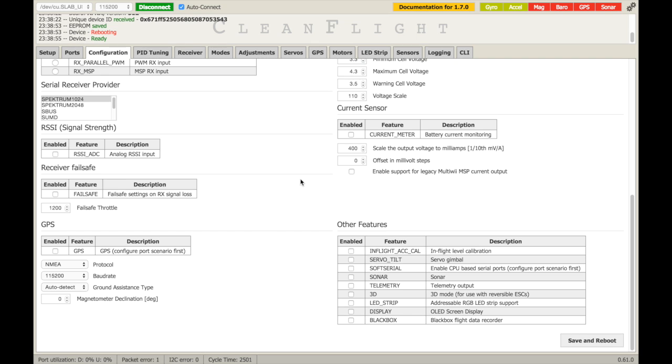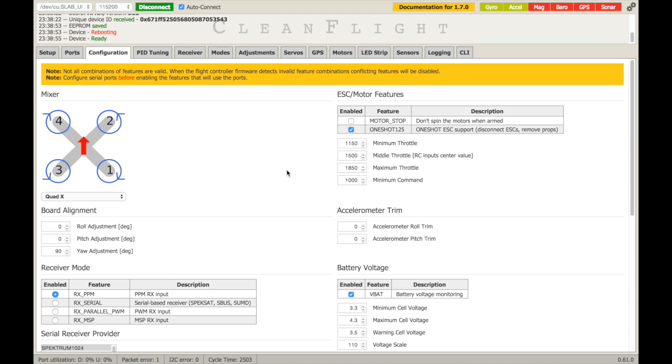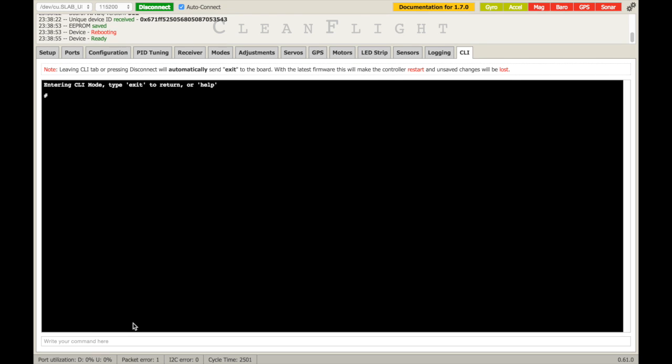She's come back — that's great. The other thing we need to do is set the loop time to about 1500. I'll just do that under the CLI: set looptime equal to 1500, and we will save that as well.